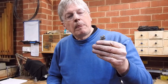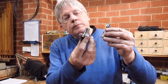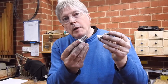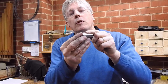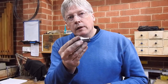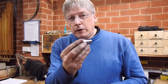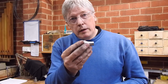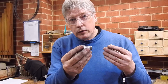So I've gone and used a setup to copy those. They're not finished — they need a little bit of work on the base and I need to make the screw part up. But the interesting part is how to get a non-linear profile from a lathe. People these days think it has to be CNC, but no it doesn't. You can do it on a manual lathe. It may not be as accurate as on a CNC machine, but it's getting pretty close if you're careful with your setup and your hand-eye coordination is good.